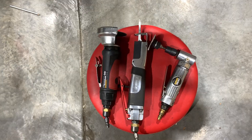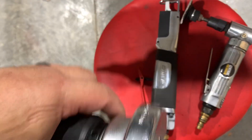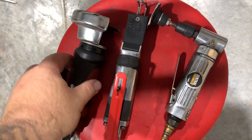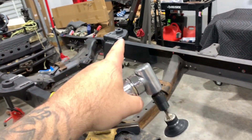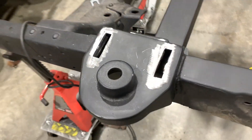So I got all the holes opened up. I quickly realized that tool was not the right tool for the job — it's more meant for little delicate sheet metal work. This is 3/16 steel on these T-slot holes, so it just shredded those belts really quick. Here's what I ended up doing: I used a combination of three tools. I used a cutter with a thin blade to cut the slots down, then the air saw to cut the two little raised parts out, and then the die grinder to smooth everything out. We ended up opening up this side about three sixteenths of an inch, so it should give us plenty of what we need.